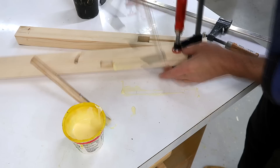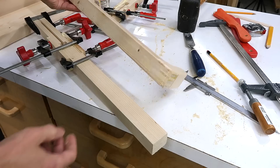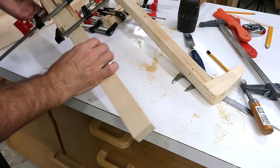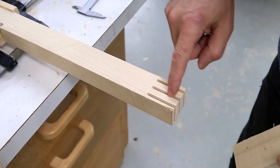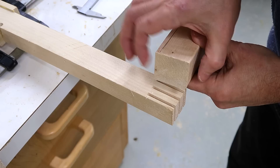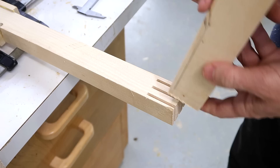This hole creates a weak spot, so I'm going to reinforce it. Now I need to cut some slots in here to attach this part, and I'll put this whole thing — clamps and all — in my box joint jig. I cut the slots in here quite narrow because this is actually the weak part; this other part is a fair bit wider and also a denser wood. Now I just need to cut much wider slots in this for it to fit into here.